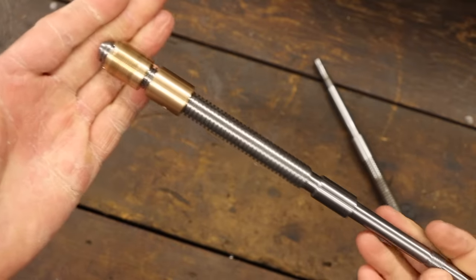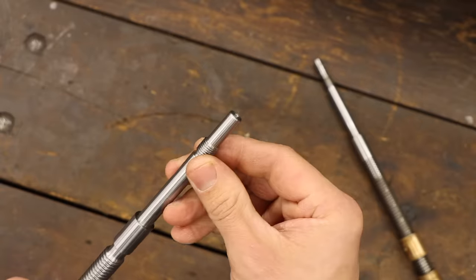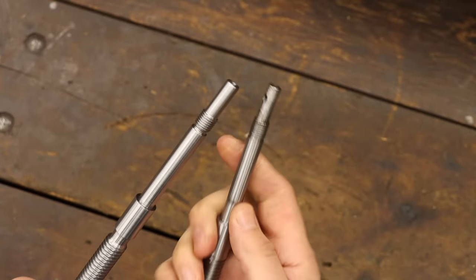So once again, I'll use the screw shaft as an arbor in the collet block and then tighten the nut against the collet. This nut gets a set of spanner slots which are easy enough to do with the slitting saw, and the other nut just gets a shallow hole for the retaining screw. All right, that's everything. Let's get this all together. Almost forgot something. The set screw hole on the handle.